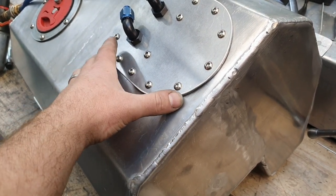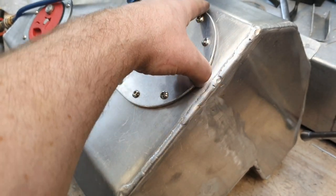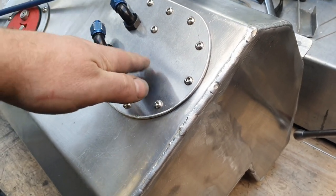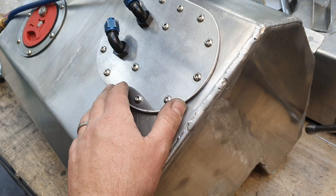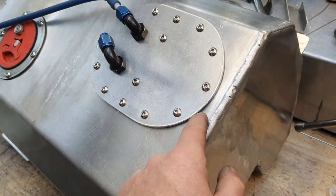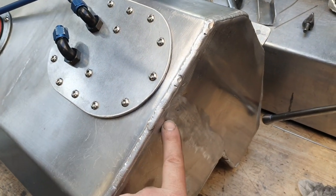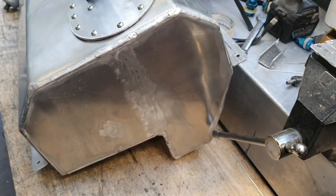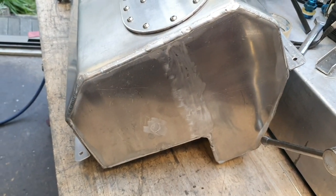This area probably needs a rubber gasket rather than the paper gasket, and I might have to put a flange under there — a four-millimeter-thick flange. Since it's an oval shape we can tip it in longways, poke it in the hole, clock it around and get it seated on the inside. Pretty easy to sort out — that'll give more strength in that area, which it seems to need. It is leaking badly right now, but that's because I've had it apart and welded down here and distorted the area. I'll do it properly and put a flange on the inside.